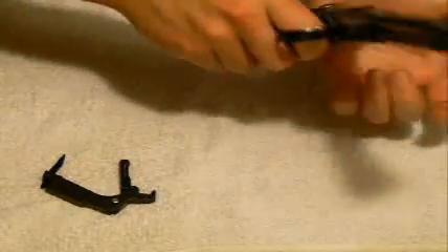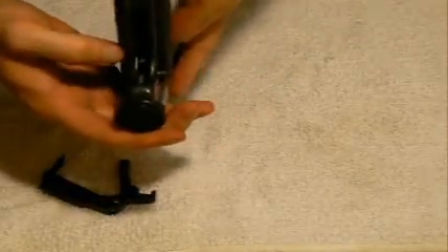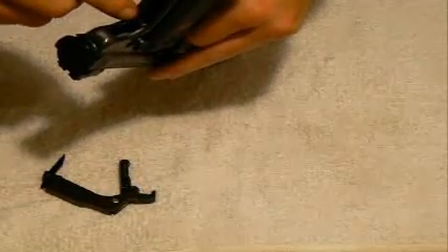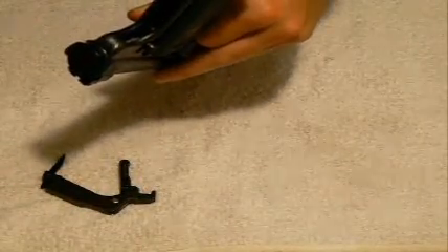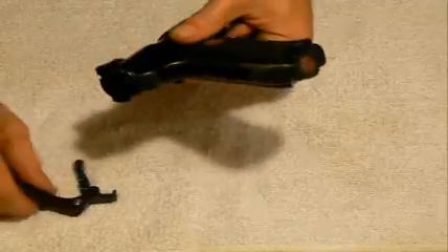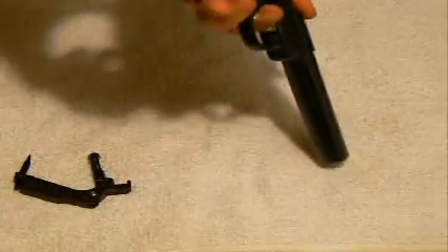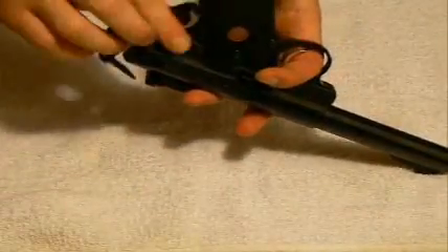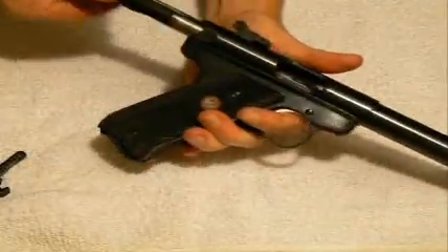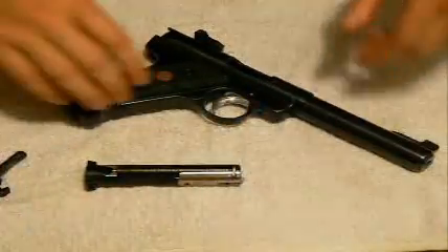With the firing pin depressed, I want to make sure that pin is not going to catch as I pull this back down — and of course it will. There's actually a little pin inside there which that lever catches on the cross beam, and that can really make it a pain to take the pistol apart. So I'm going to use this pin and put that back in there, and now it will allow this bolt to come all the way out of the pistol. Turning it back around — this isn't going to be one of my finer videos, but here's your bolt finally removed from the pistol.